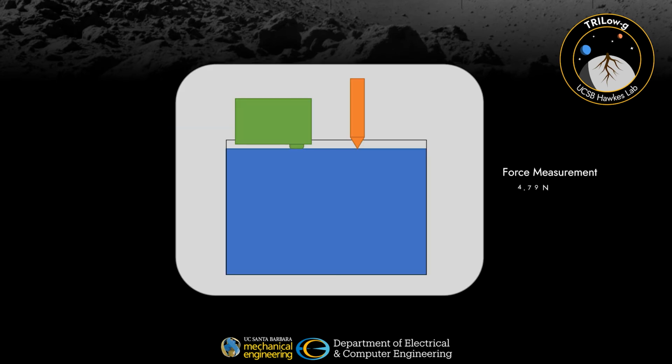Now, a test of just a soft robot is useful, but being able to compare it to a rigid device called a penetrometer is even better. Including one gives us a measurement of the soil we're testing with and its preparation, and another anchor-like device to compare our soft robot to. To this end, the next trial that is performed is with the penetrometer. Much like the soft robot test, the penetrometer is pushed into the soil bed to a specified depth and pulled out, all while force and position are being measured.